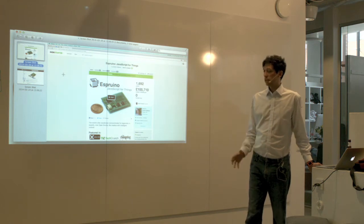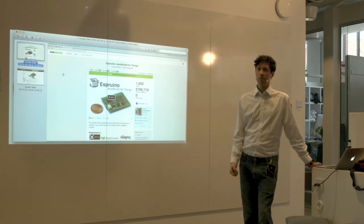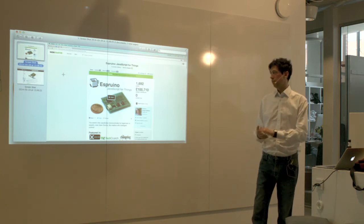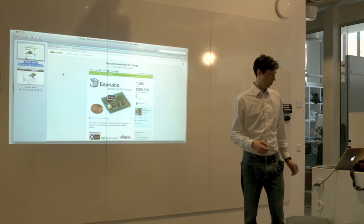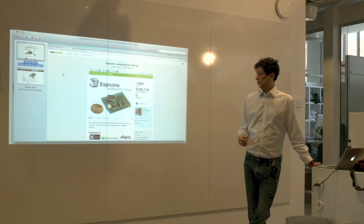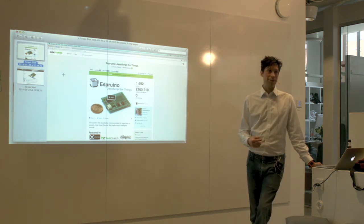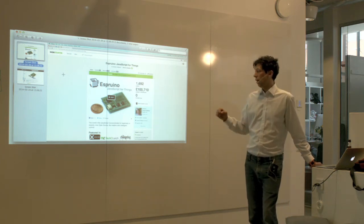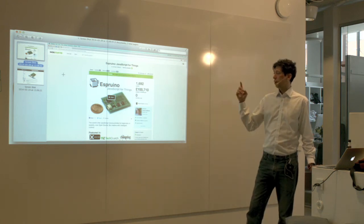So that has its advantages, but the big disadvantage is that it takes more space than binary data, and if you use a driver that's written in JavaScript, it's maybe sometimes up to 3K compressed. And the typical memory for persisting on a microcontroller is like 8K, I think. So there you almost used up everything. And this was one of the reasons he decided to launch his own board.